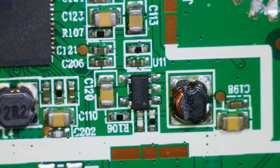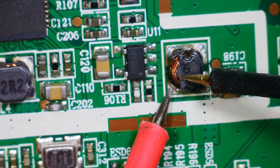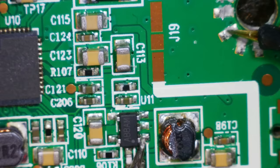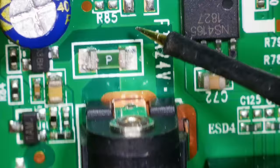But it looked like it was these here — but they're not capacitors, are they? Let's see if there's any shorts in that area. We've got continuity through this coil. That to me looks like it's got hot and burnt, but we do still have continuity through it. Let's just plug the power back in — we're beeping the top of the capacitor again, so this is all ground again.